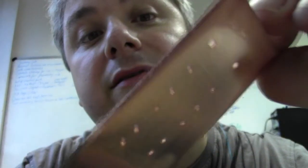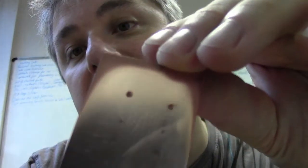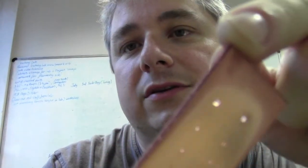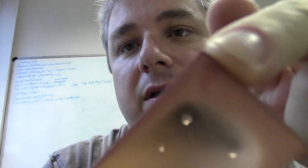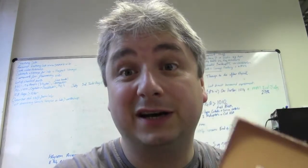And if you look just around this area here, you can maybe just make out my glove imprint, so be very careful. I accidentally gripped the board up here when I was putting it in the tank. I wasn't paying attention to which end I picked the board up by, and also left, as you can see in that top corner, my fingerprint. You can immortalise yourself in copper if you're not careful. That's why you make sure that you wear gloves. If you wear gloves, you get that sort of imprint. It's nice and shiny. It's still connected perfectly fine.